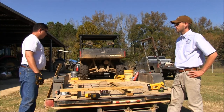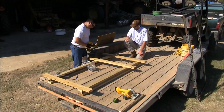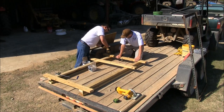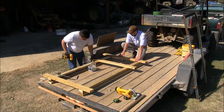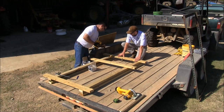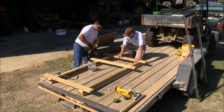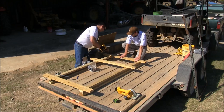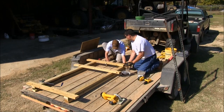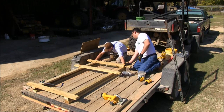Now we're just going to do all the cross members and then our door is almost ready. I'm finishing these supports under the cross members, putting them in with two screws because I don't want to fully go through into my track. I'm using five on each side. We're measuring the top to make sure it hasn't moved — inside to inside — to make sure we're still at our 33 inches, which we are.